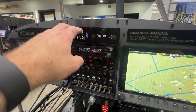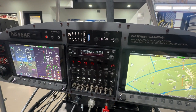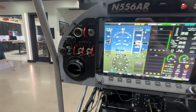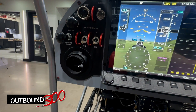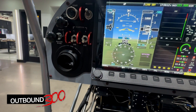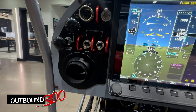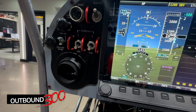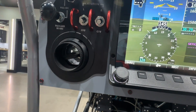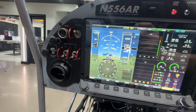I have an autopilot panel and heading/barometer/altitude bug panel here. Over on the left side I've got my master switch and my two ignition switches — those are breaker switches since I'm doing the dual Lightspeed ignitions. They go straight to the battery on their own bus effectively, and those are five-amp breaker switches, though I can't read it from here and don't remember at the moment.